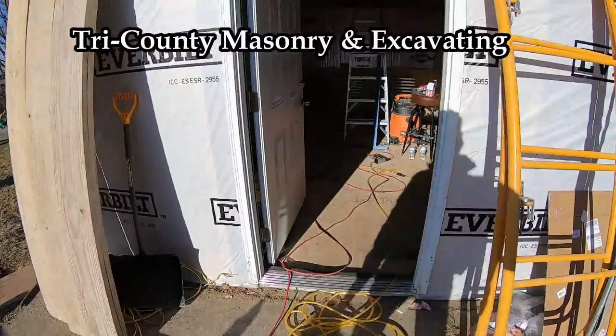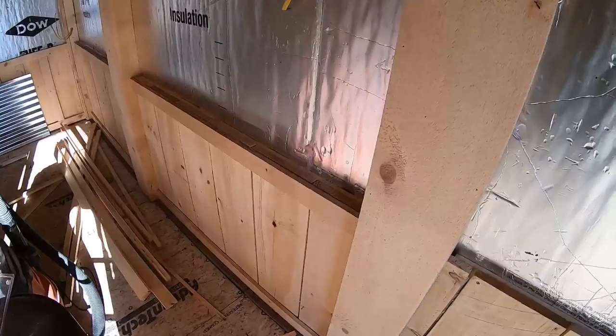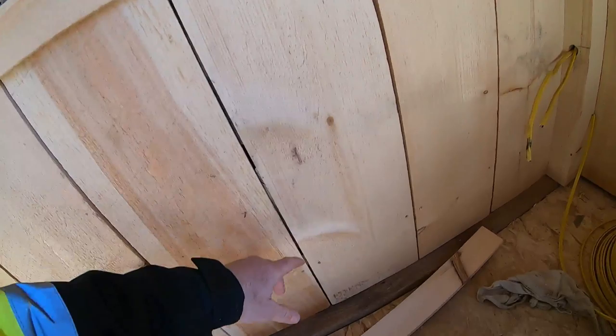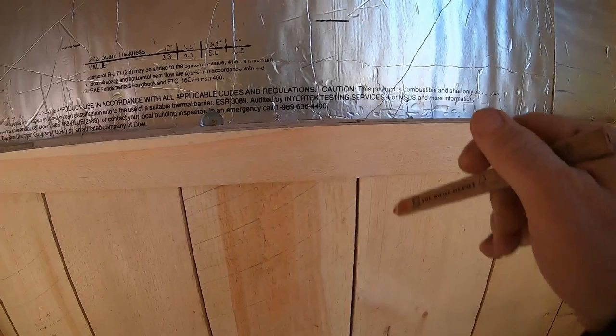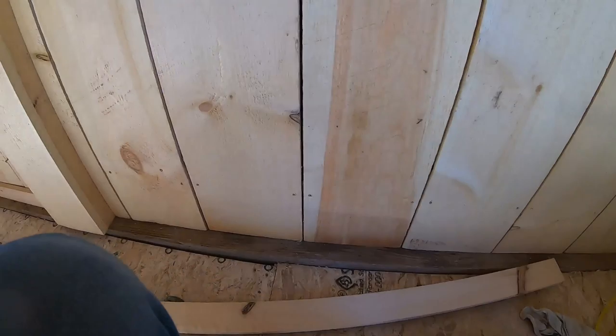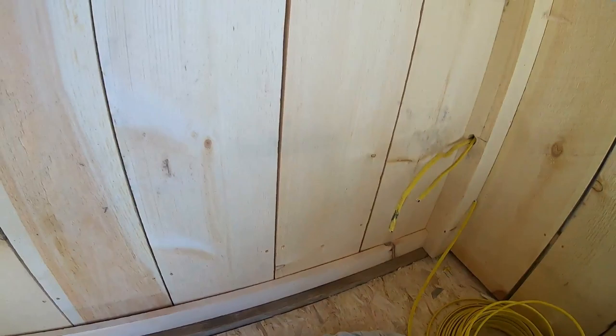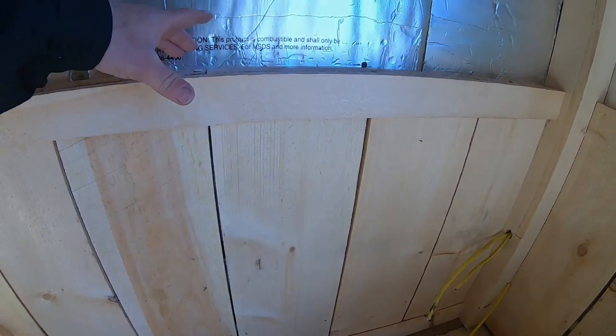Back on site, got the wood for the bats, just putting them up now. I put a border on the top, border on the bottom, then I'll put the crown out. I measure my height from here — 32 and three quarters — nail that center up. Once I nail that center, boom, just make your ends up to that height, put the bottom piece in nice and tight, push tight and nail it. Then you just measure your stickers and they should all be the same.